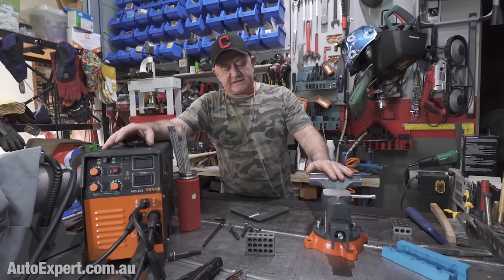I'm making it so I can fit the vice to all four corners of this bench as needed. If you wanted to do essentially the same thing, you could buy a cheap solid-core door, clamp it to two sawhorses, and achieve the same thing as a portable work table solution. Having the vice there just makes a lot of operations on location much safer and easier — such as every operation you might conceivably do with an angle grinder. Then I reassemble the vice with the M10 swivel base clamping screw upgrade, throw a bit of grease on the lead screw and the swivel base, and fit the whole thing up. Overall I'm pretty happy with how this turned out. The problem with all DIY is this is prototype number one — by the time you get to number four that'd be pretty slick, but I don't have four times the time. This has been ghetto engineering certified as good enough to do the job — it'll probably outlast ten or twenty sacrificial benchtops out on location.